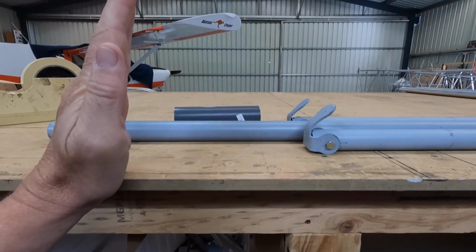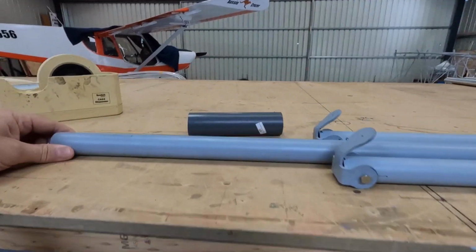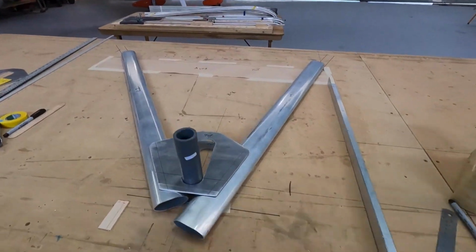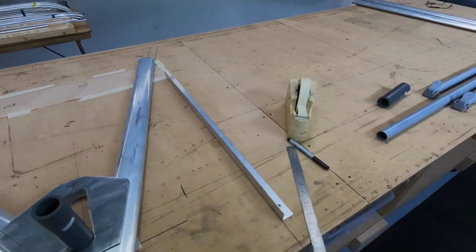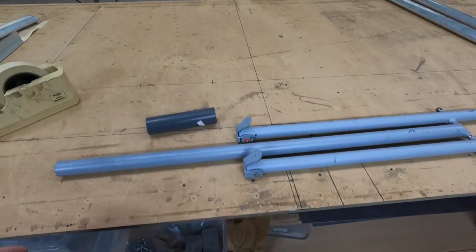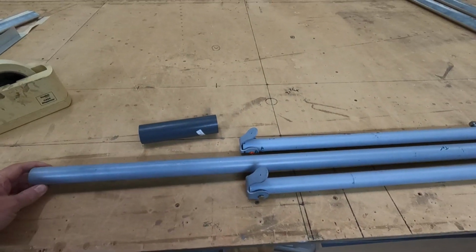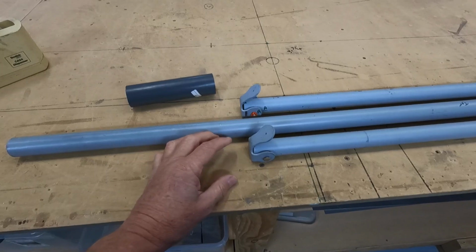Say for instance you broke a bungee on landing, the aircraft would limp back with the axle up at the top of the slot. So potentially the aircraft could be on a big lean, and all it is a $5 bungee, but it'll look like a $5,000 repair as you taxi in. So a lot of angles going on.